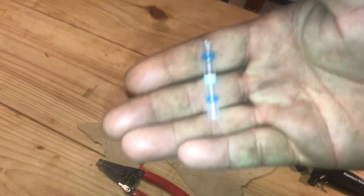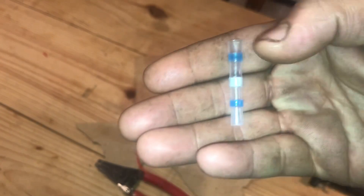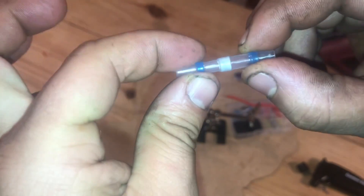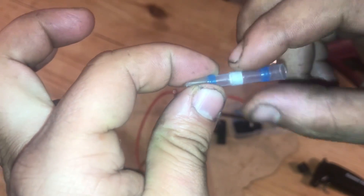We're going to talk a little bit about this heat shrink connector. If you didn't see part one, here's a quick overview. What we're trying to do is replace butt crimping with this solder connector. You can see the solder right in the middle, and on the edges in blue is the sealant. When we heat it up, the sealant turns into a gel and seals the two wires, while the solder liquefies to give a tight grasp on the wires.